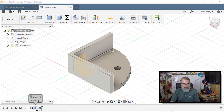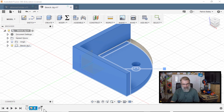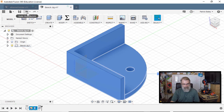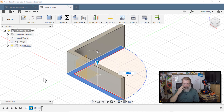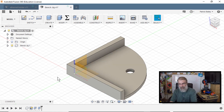I'll go back into my sketch and right-click on the extrusion in the history to edit it. I can edit this feature — the extrusion — which I had set to 35 millimeters. I don't think it needs to be anywhere near that tall, so let me drop it down to 15. And for the other extrusion, I don't think it needs to be that tall either — it was at 7, so let me drop it down to 4 and see how that works.